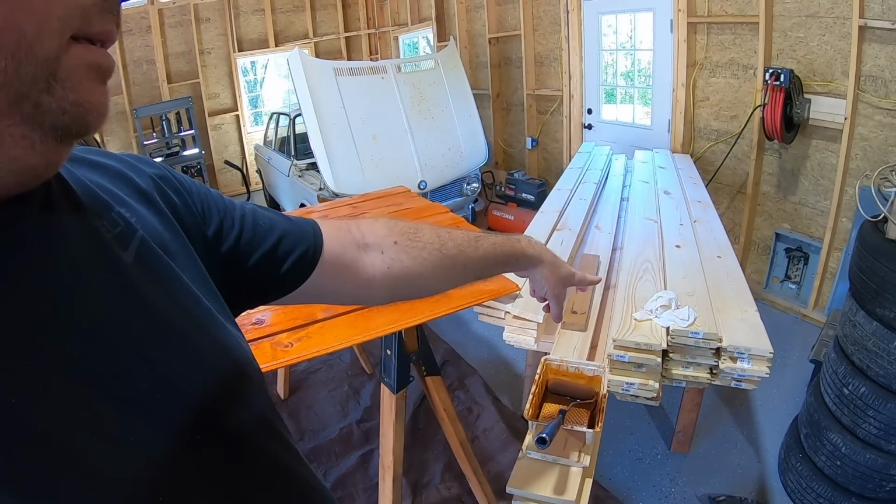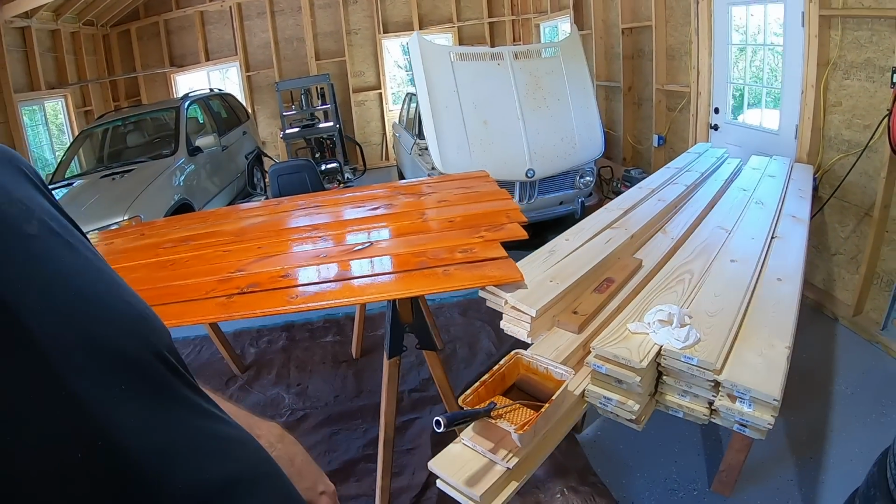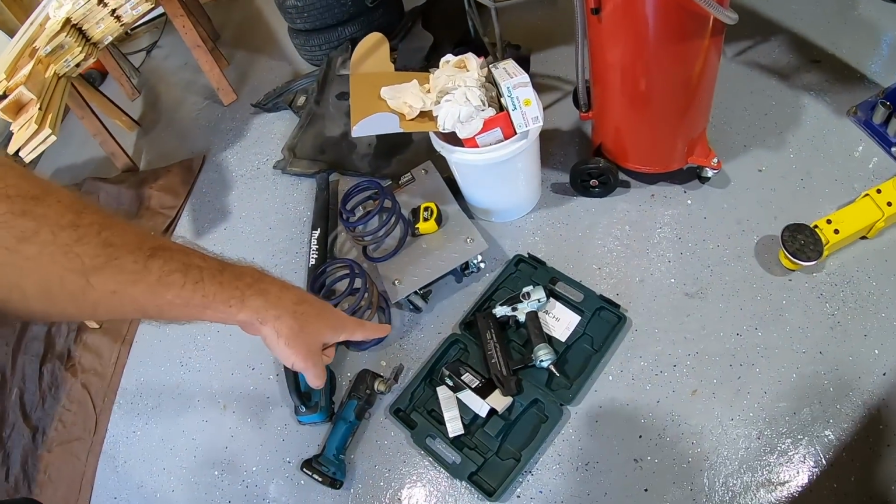So that's what's been going on here at the shop today. And probably what we're gonna do is use a lot of this stuff on the inside too. Because I could stain this like a natural color, or just where it's barely tinted. And that's gonna be a lot easier and a lot nicer to put up than drywall. It's gonna cost a lot more, but especially on the ceiling, we go in and put like a 7/16 regular OSB on the inside. We could even zip tape all the seams so it's nice and airtight, and then go on with the brad nailer and put all this stuff on. And we're shooting these with 2-inch brad nails, and it just goes on so easy. It's such an easy deal.